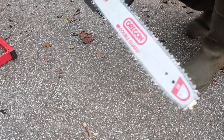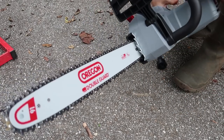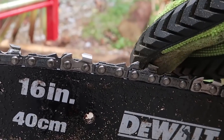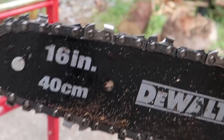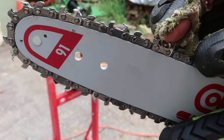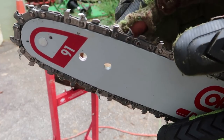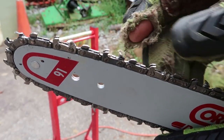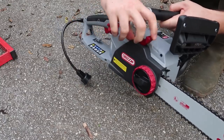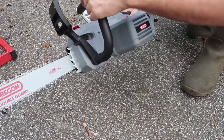Let's see if the blade is different at all. Looks like it's 16 inches — it tells you right here how big the chainsaw is. This is the original chainsaw tooth; as you can see, you have to sharpen it from the inside and some from the top as well. This chainsaw is very different — the sharp part is mostly from the top right here, not from the inside. Much, much different setup, but this is what makes self-sharpening possible. This is how you're going to self-sharpen it — just pressing it up while you're running it. Looks really good, pretty light.